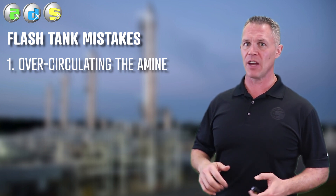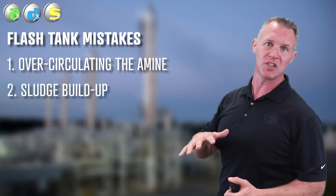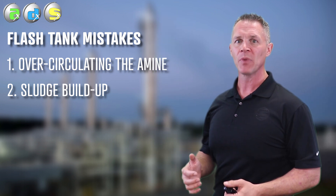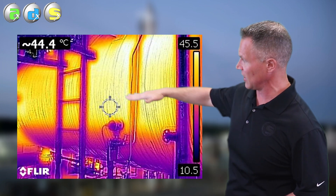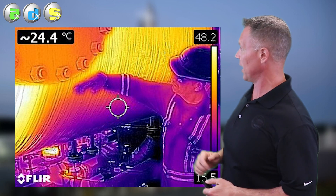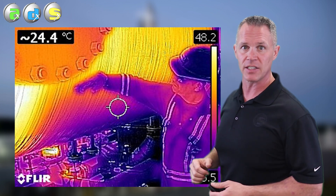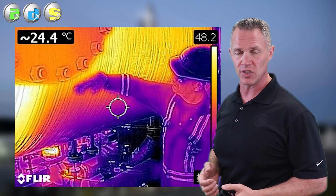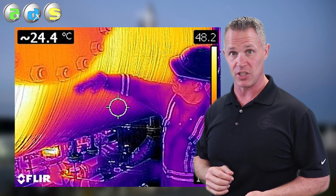The next issue is that if the flash tank has been in service for a number of years, you can build up sludge in the bottom of the flash tank. We like to use a thermal imaging camera to go out and diagnose if the flash tank has sludge in it. Here you can see an example — that dark, cold area in the bottom of the tank is the sludge buildup. My colleague Eduardo, using these FLIR cameras you can buy on Amazon, showed the level of sludge — it was like a third of the tank was full. So even when we keep our normal liquid level of about 50–60%, our residence time gets significantly reduced if the bottom third or more of that tank is full of sludge.